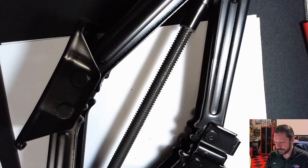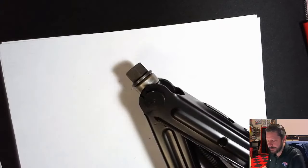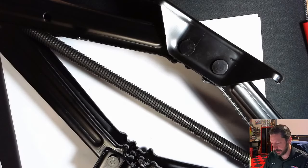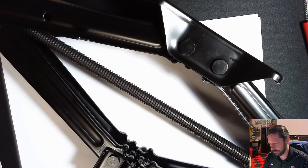Typically, a lead screw is for moving a piece of machinery relative to the rest of the machinery. So you would think maybe on a lathe, you have the screw along the bottom there that you can move the carriage back and forth with. That one you'd probably call a lead screw, whereas in this case, you're still moving this nut back and forth, but the intent is that you're lifting something up. So they work all the same. There's no difference in the way they work, other than power screw typically means you're lifting or moving some heavy thing. Lead screw usually is a piece of machinery where you're moving one thing, like the carriage on a lathe, back and forth without really moving a lot of mass, but they work the same.